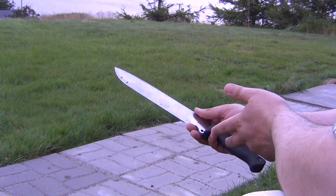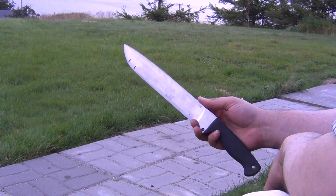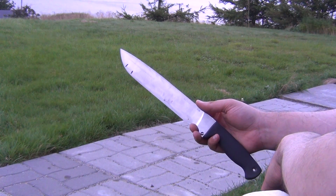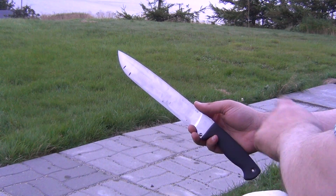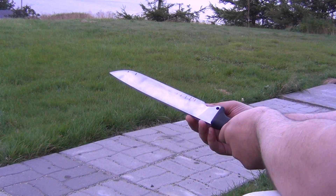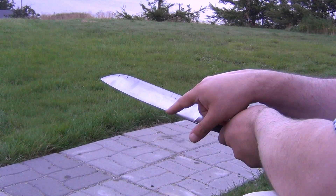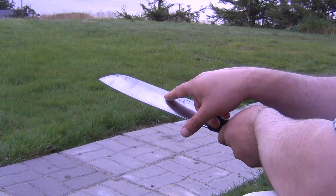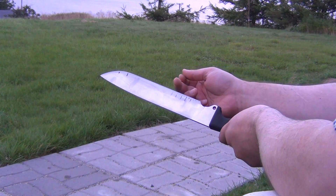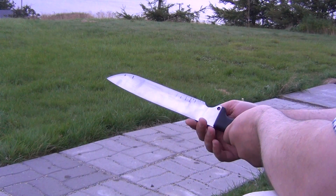For some perspective, while these knives do get lambasted an awful lot at times, the edge on this was just slightly thicker than the edge on the XM18 that I have with the slicer grind, which is a little tiny folder, and the angle on this was less. What I've actually done is put a relief grind into the primary — the primary grind was flat, and there's a very slight convex in the last centimeter or so, which thins out the secondary edge so it's only around 15 thou thick and currently around 10 degrees per side.